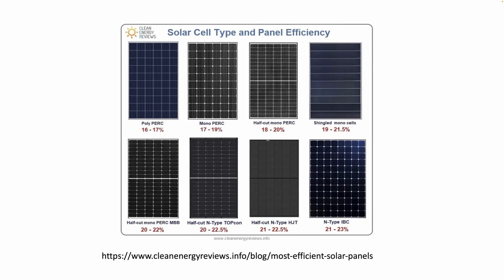At the end of the day, is it going to produce the voltage and current you're looking for? Probably yes. If you're looking at an off-grid installation for a cabin, or living in an RV relying on PV systems, maybe it's worthwhile spending extra money. But typically we're looking at about 20% efficiency on most PV modules. The warranties are typically five to ten years, with wattage degradation of 10 to 20% over a 20-year lifespan. Mine are 15 or 20 years old — they still charge my batteries and keep my toys running, so I'm not planning on changing them anytime soon.